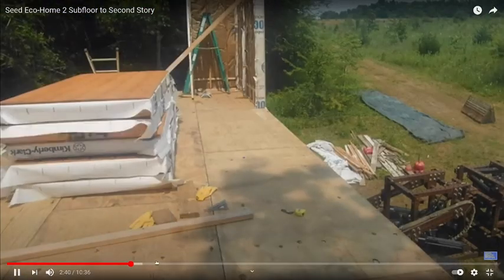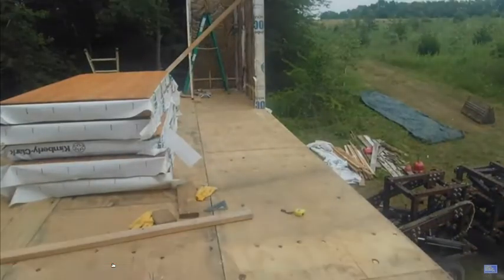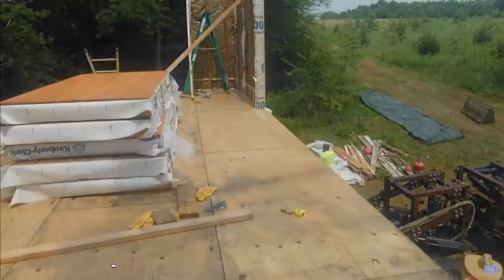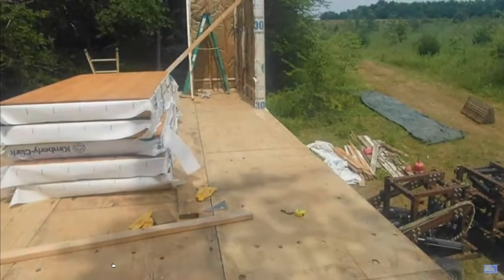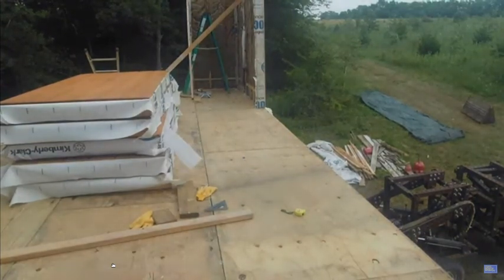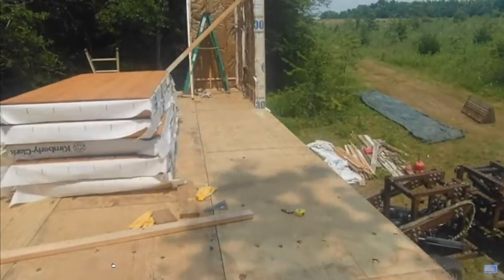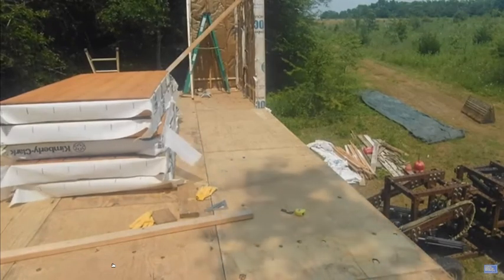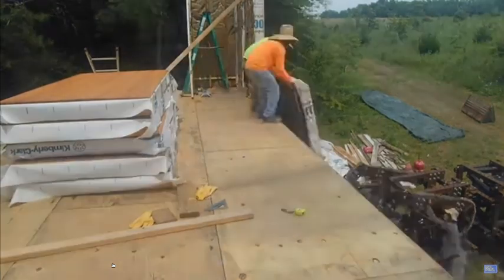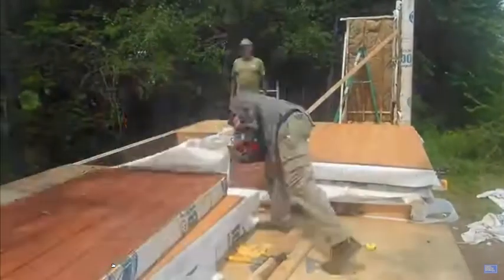But let's look at, do you think that styrofoam is just a little bit thick? Are there other alternatives of material? Not thick, it's more like cutting it. What we'd like is a little self-adhesive gasket, long strips of it that you can just glue down. Because here you have to be careful that the stuff does not slip, does not come off the joist, and it shows, and you've got to cut it out. So something that's self-adhesive and low cost, like the gasket, is good. Some kind of adhesive strip, we could benefit from finding something like that, that we put on before, as we prepared the joists.